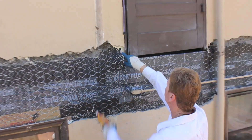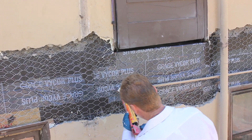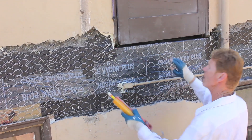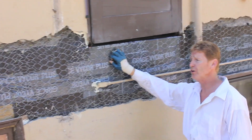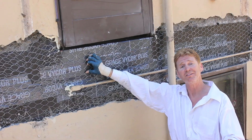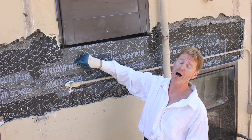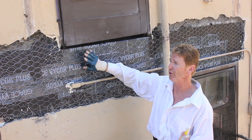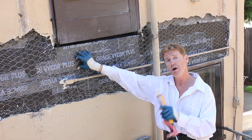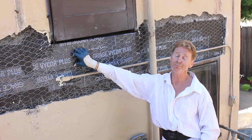We put a little caulking around there. For any of you folks, as far as that membrane goes prior to doing the ledger — to each his own, but I definitely recommend this. It would take me another 10 minutes to tell you stories of people who put ledgers on stucco without the grace membrane behind and how many have leaks. So we just don't like to do it. Anyway, hope you learned something from this and how to do the ledger correctly if you're going to go over stucco. My name is Kirk, I'm with Kirk Giordano plastering. Thank you folks for watching, and as usual, see you on the next one.